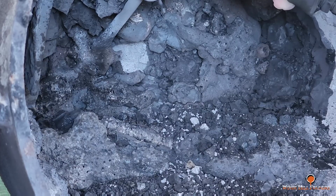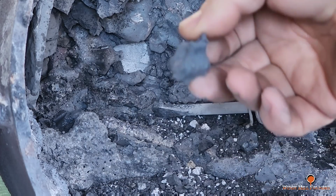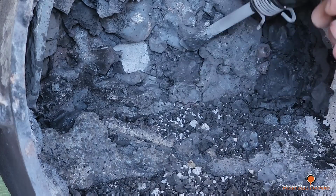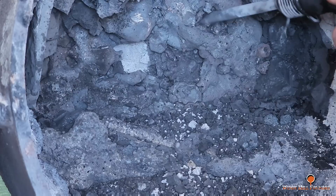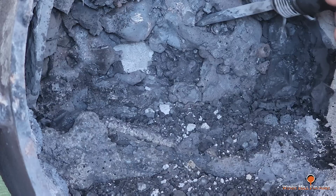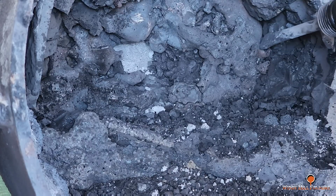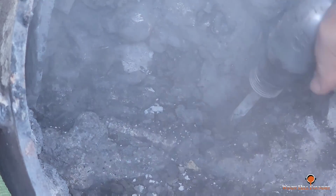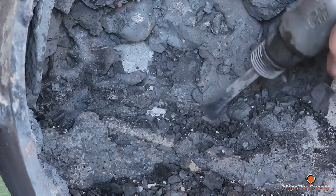Well, guys, what you are looking at is iron interwoven down in the refractory, and sometimes it would actually have a reaction to the refractory and liquefy and fuse to the bottom, forming little caves. And in all, we removed about 60 pounds of iron out of the bottom of this furnace. Keep in mind, as I've said, we've been running this thing for 2 years, so it accumulates over time. But on that last melt, we did dump an additional 10 pounds in there that I'm working on, as you see here.